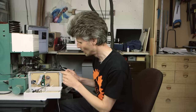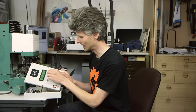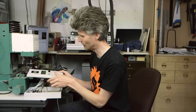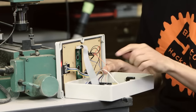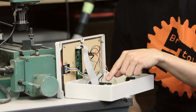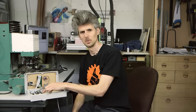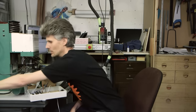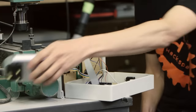So let's have a look at what's inside the box. On the front panel we've got an LCD and a rotary encoder on a button, and the RFID reader is just behind that panel there. And then we've got the Arduino Yun Mini right here with a beeper and an AM 433 megahertz transmitter that transmits to plugs like this, and that's how the access is turned on and off to the different tools.